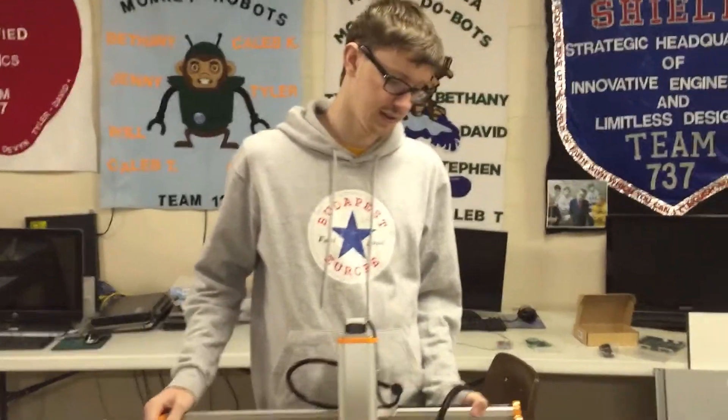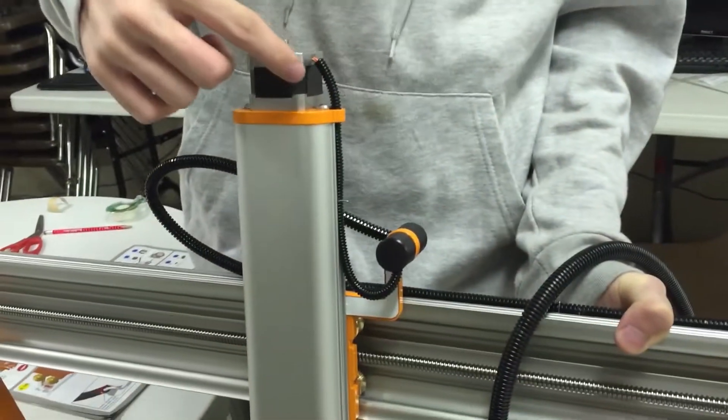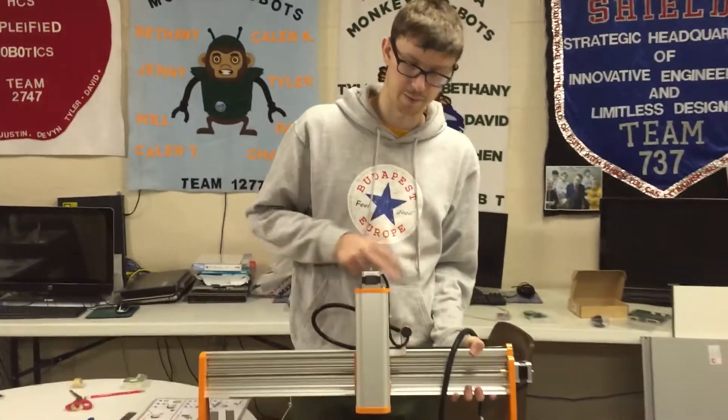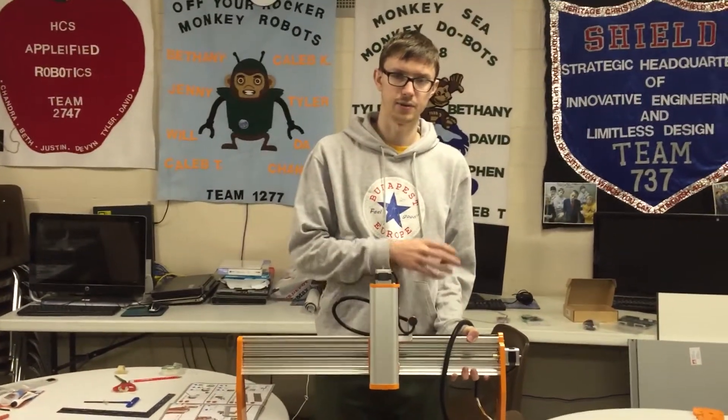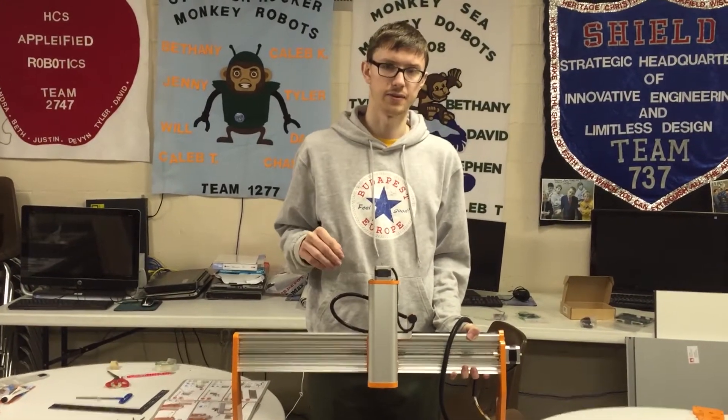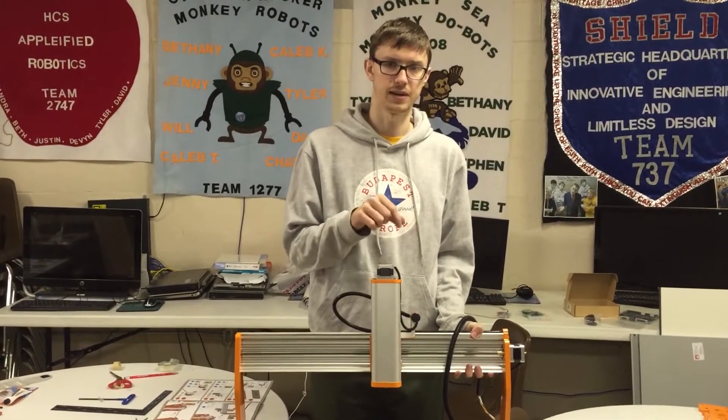It's important to keep track of the wires. There's a lot of snaking that goes on — you have to snake the wire through here, and then it doubles up in this tube, and then eventually it's going to triple up in this tube. So it's very important that you make sure the wires are getting routed through the tubes at the beginning, so you don't have to go back and do it all again. What we did is we taped the wires together and pushed them through as one bundle so that we could get them through faster.